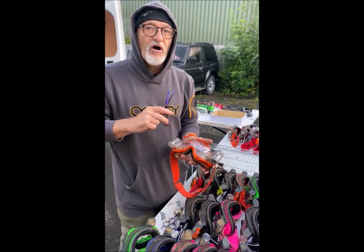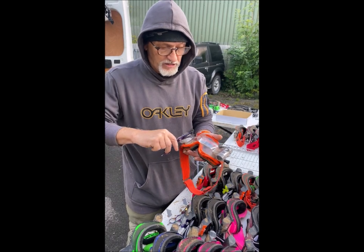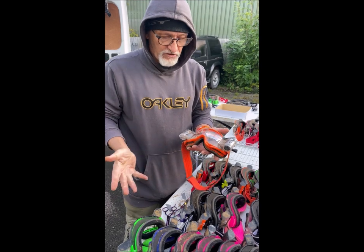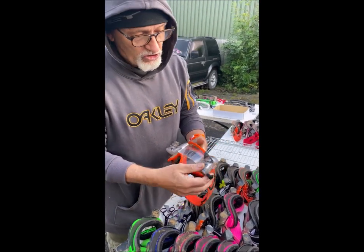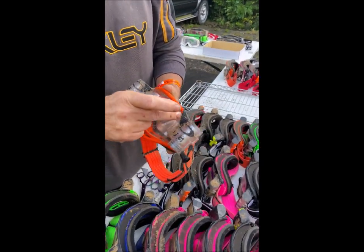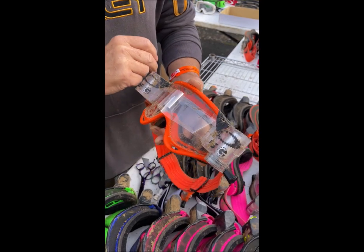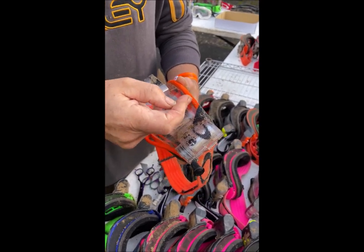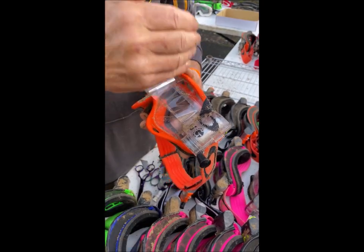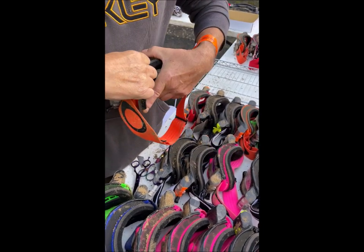Don't cut the fishing line — be careful. So cut the film first. Next job: remove the tape. The tape will be stuck to the mud strip. If you pull the tape up, you're going to pull the mud strip off, and once you've pulled the mud strip off the sand will drop in and it won't go back down properly. So when you peel the tape off, peel down — not up.